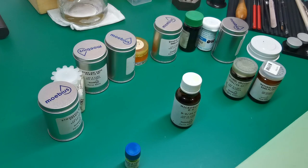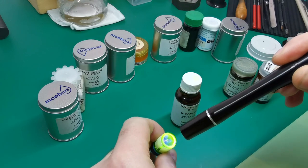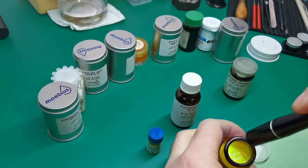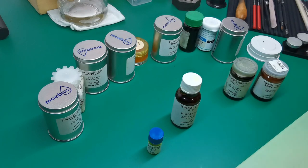The variations I have in mind is that I use a fluorescent type of lubrication, which helps me with quality control so I can see that the lubrication is correctly applied and isn't moving into parts of the watch where I don't want it to go. Using my UV pen, you can see this lubricant is a fluorescent yellow — it shines under UV light — and this grease here is also UV reactive. The lubricants I list in the description will not be UV reactive; the standard greases are just fine, but in my workshop I like to use fluorescent lubricants to maintain quality control.